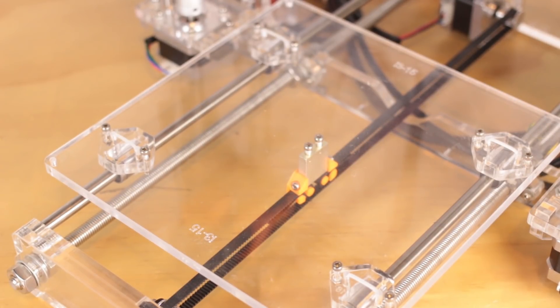Word to the wise: you're going to want to use a high temperature plastic for that part. I originally printed it out of PLA instead of the ABS that you're looking at, and the PLA part softened — the belt tension kind of warped it so that my belt just fell off. That happened when I put the printer in an enclosure. You might be okay with PLA if you're printing in the open air, but high temperature plastic is probably your safer bet.